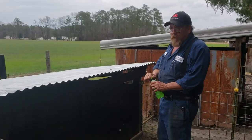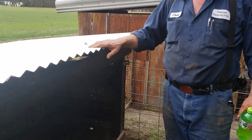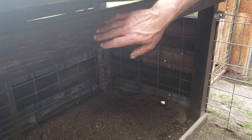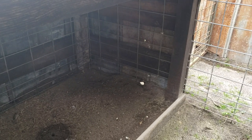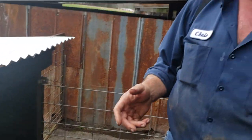This shelter is actually tall enough for a full-size grown sow or boar, but it's not deep enough. This one is four foot by eight foot. It's built out of rough cut lumber, just like a pole barn — you put four posts in the ground, nail some boards up around it, and put tin on top. You can use tin or plywood; I usually use tin because we can get used tin for next to nothing or free.